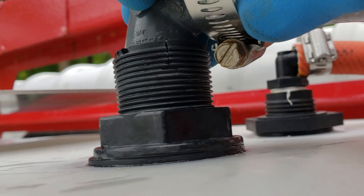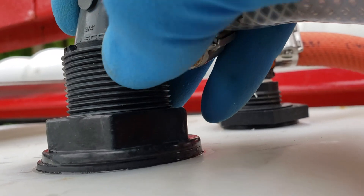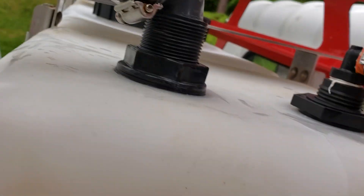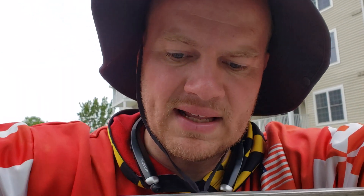We've got a nice crack right there in the bulkhead. I realize this is threaded with the bulkhead and the pickup pipe is threaded in the back. This right here is why we're sucking air — that little crack. And it actually looks like there's another one somewhere else on here. We've got the split there. Those are what's making the seal fail, causing air to get into the system.